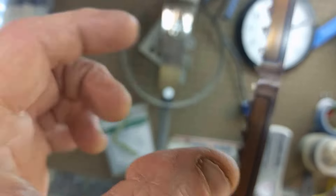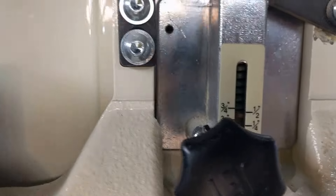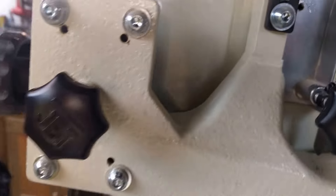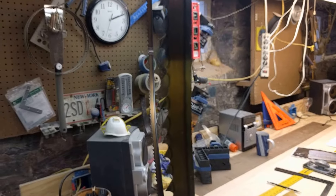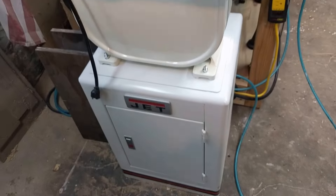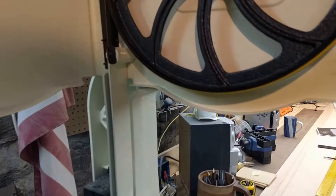What does that tell you? These blades when they're manufactured can be just a little bigger or a little smaller. You can come back here and adjust this wheel up and down to compensate. Nothing I did helped, though. So the very first tip is: before you order your blades, consult the manufacturer. In this case it's Jet — this is a Jet 14 inch. I really like this unit; I did a separate segment on it.